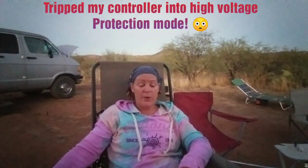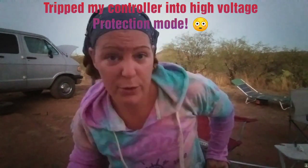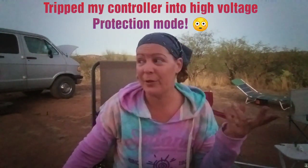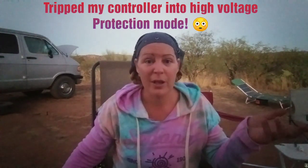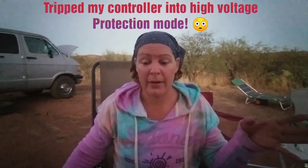Before closing, guys, I'm pissed. I'm out of ideas. I'm stressed, so I'm just trying to relax now, because when I put the negative wires back on the batteries in the back, when I checked the controller, it said 27 point something. So that told me that there was a major surge of power going to the controller. Mark and Terry went for a four-wheeler ride, so he wasn't here to help. So all I could think of to do was flip the breaker, take off the negative cables again, and take out the battery that we just put into the original battery box.